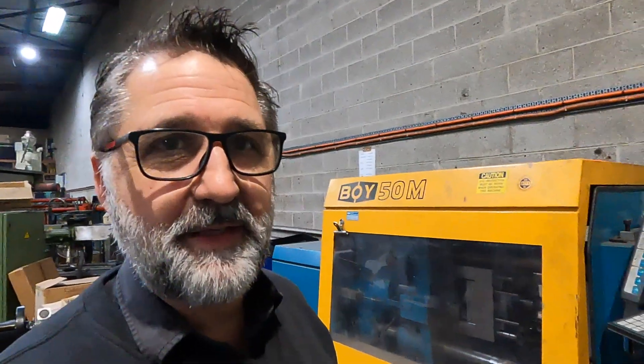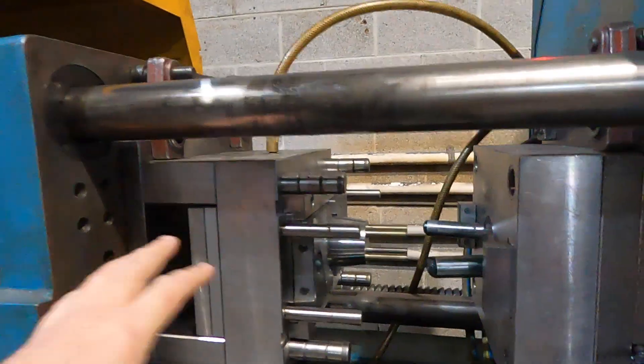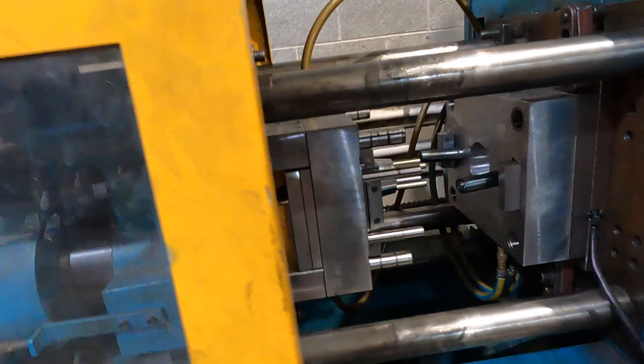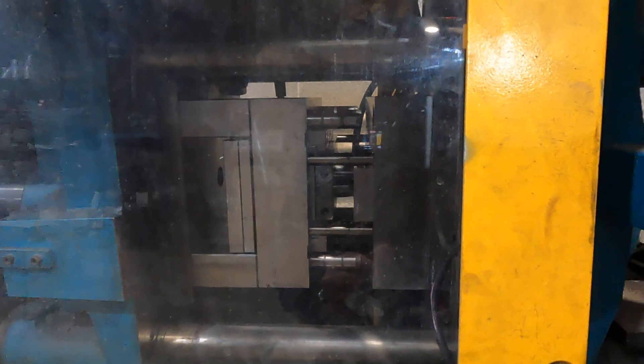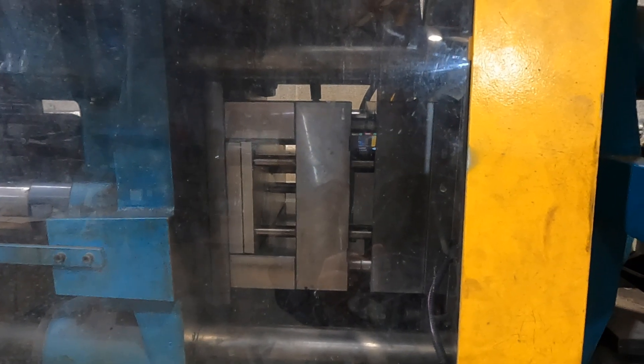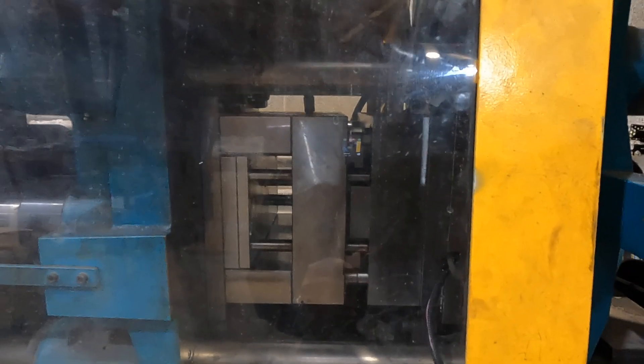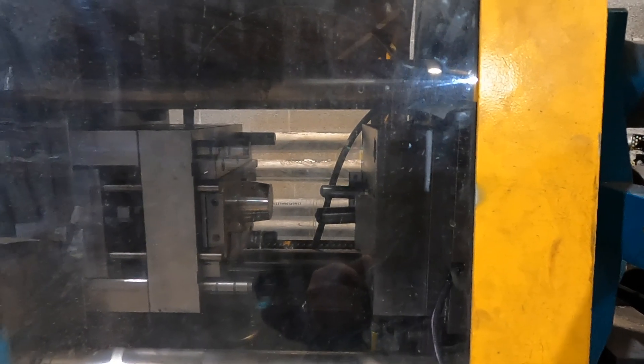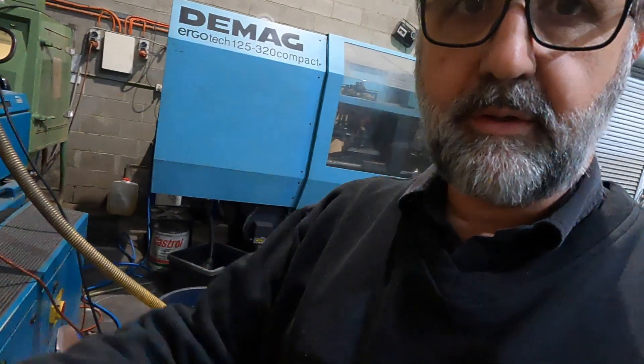Here we are down at the plastic injection moulder. We've shot the die in and done all the opening and closing programs, so we've got all that sorted out. She'll close and open quite nicely. We're just waiting for temperatures to come up at the moment. Hot sprue's up already. The die closes, and we're just on very low speeds at the moment because the die's actually not hardened. Die opens and ejects, and the idea is they then fall off down to this little box down here. Away we go.